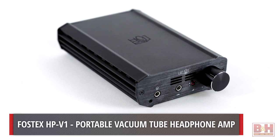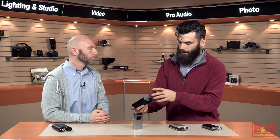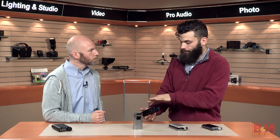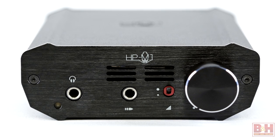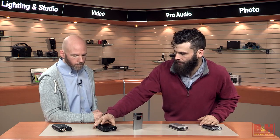This one from Fostex is a little different — it's not a DAC, but it can work with all of these. We wanted to include it because it's a pretty unique product. For people who are used to listening to music on vinyl or who talk about the analog warmth that sometimes feels lost now that we're into digital music, one of the ways to recapture that experience is by introducing vacuum tubes into your signal chain. This is actually a portable, battery-powered vacuum tube headphone amplifier that can be paired with any DAC or even your phone directly. It adds a very pleasant form of harmonic distortion that audiophiles sometimes prefer over the very digital, transparent, clean sound you get from more solid-state amplification.